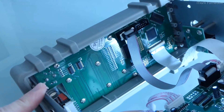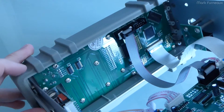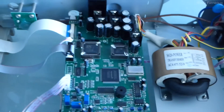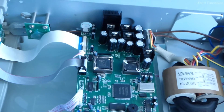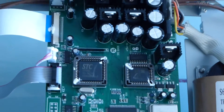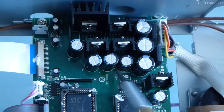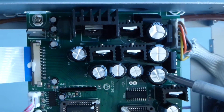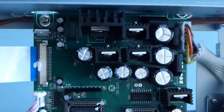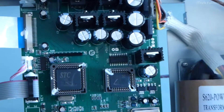We'll take a look at that in more detail later. This is the front panel display board — you can see a couple of chips on here and a couple of ribbon cables, as well as a small board down here for the outputs, which we'll also take a look at later. The main board looks relatively standard. On this side we've obviously got all of our linear regulators for the various power supplies that this unit needs. Some of them are labeled on the board — you can see plus five volts there, but that's unfortunately the only one that's labeled.